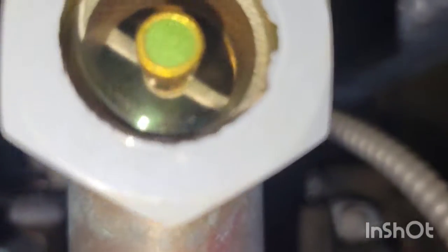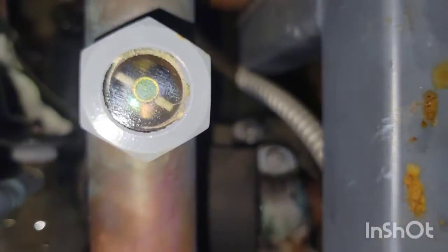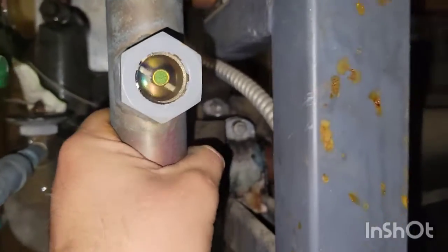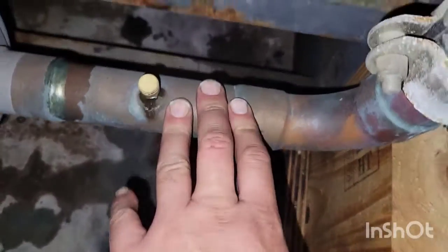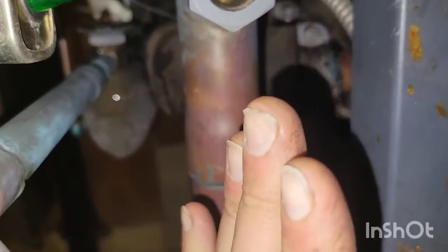Let's try turning off the lights. And if you look really deep in there, sometimes you can see just like the littlest bit. You can tell that there's a liquid in there, but it looks clear as glass. So that means we have a full column of refrigerant running up in this pipe. Also worth noting, the angle at which this comes off is important. When it's on the pipe like so, at this horizontal, jutting out on a vertical, you're almost always going to have a clear looking like this. When it's on top like this, it'll actually look completely different - it'll almost look like you're looking down and you want that pipe to be full.